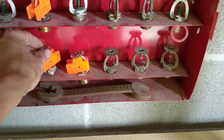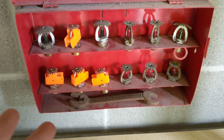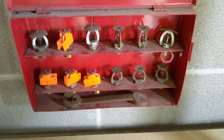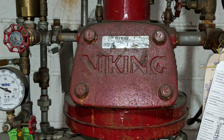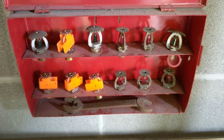The main focus of this video is changing out a sprinkler head and being aware of having the right system shut off, because a lot of times you run into a facility where they've got multiple systems and you never know if you really got the right system shut off. So I want to give you an idea of what to look for.